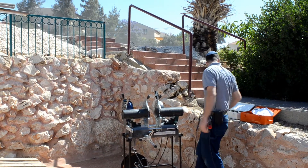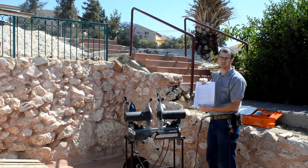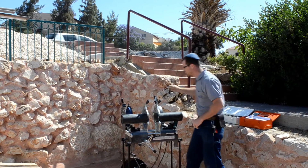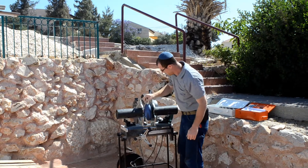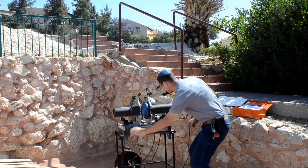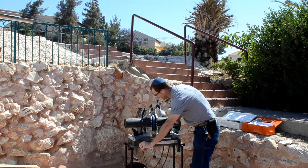Next, 4 inch pipe. We have a chart over here that tells us exactly the pressure and the time. The heating plate has been preheated. Bring it down. We're going to bring it to 209 — that's the pressure we're going to use.